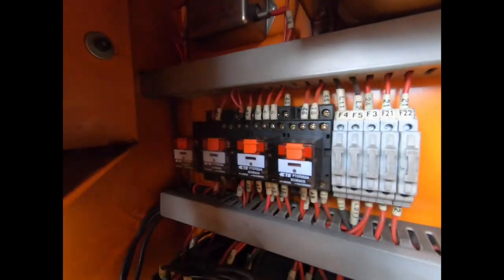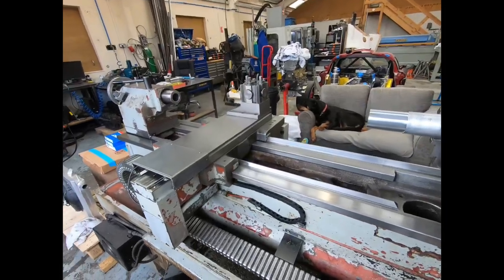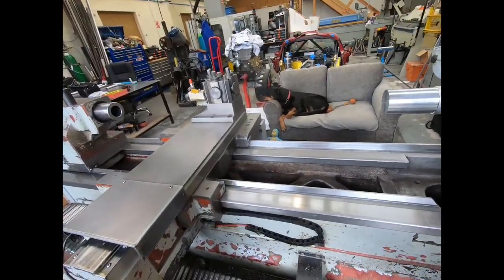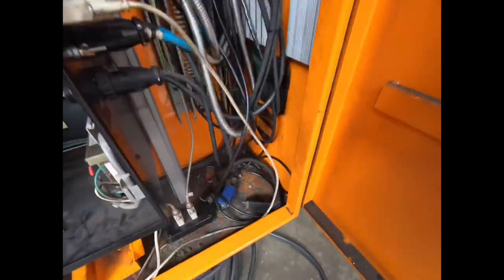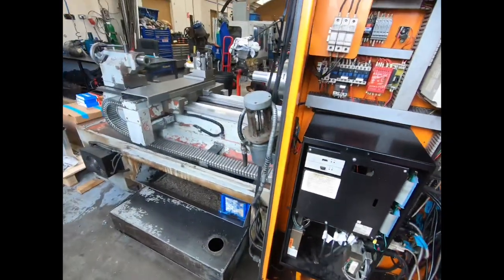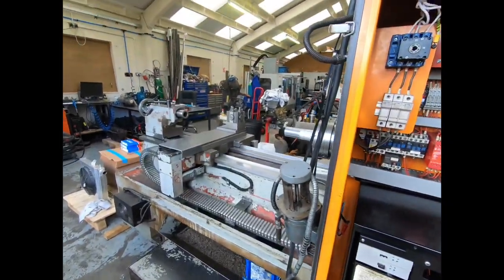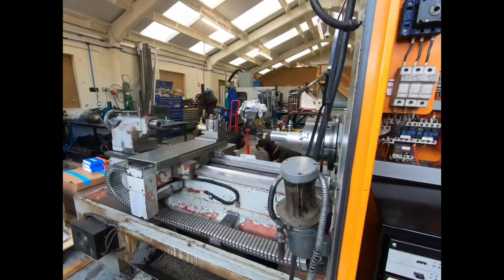Some contactors in there. There were a couple of downed relays because reverse wasn't working. Someone had wired up the switch and by the look of it just lashed it up so that forward worked on a spindle, but now forward and reverse both work correctly. All the interlocks are currently wired and they're down there because obviously I've taken all the enclosures off the machine — I needed them plugged in so it still runs when I'm checking stuff out.